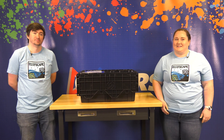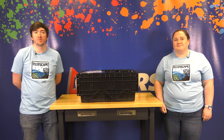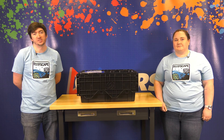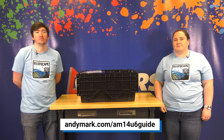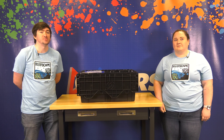Looks like a great starter robot for teams. Let's jump into showing teams how to build it. First, we want to note that while the KitBot superstructure could be integrated with a variety of drivetrain shapes and types, it is designed to most easily integrate with AM14U6 chassis constructed in the long orientation, and that's what we're going to be doing tonight.